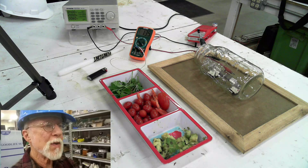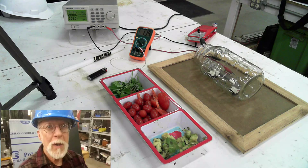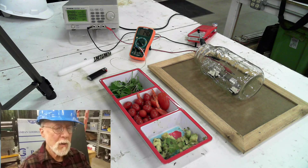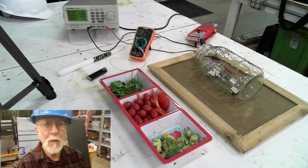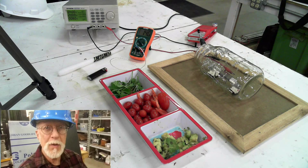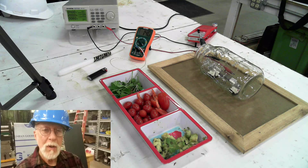And it seemed to work. When you take one of these joints apart, you see a little ring less than a millimeter wide of aluminium that's been embossed into the ceramic, and you can't feel that metal with a sharp knife scraping across it. That means that there's no metal deposited above the surface of the ceramic. It's actually embedded into the grains of the ceramic material, at least within the limits of maybe a tenth of a thousandth of an inch. We'd have to look with a very, very good microscope to see what's going on there.